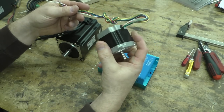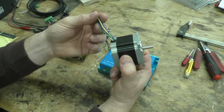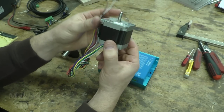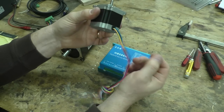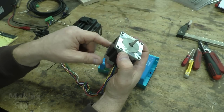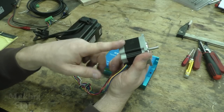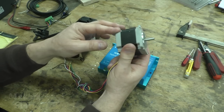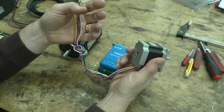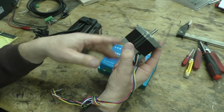Anybody that has messed with 3D printing or hobby CNC probably knows what this is — just your regular old open loop stepper motor. These motors work great for 3D printing and hobby CNC, but the main drawback is that if they lose a step, or you reach the limit of your machine, the motor has no way to communicate back to your computer or controller to say hey, there's a problem, or I tried to move 10 steps but only moved 5.